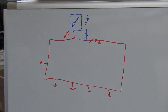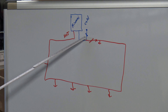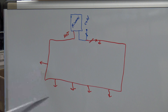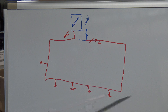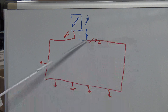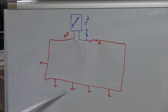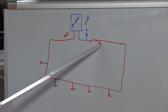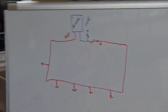Here on the dry erase board: a typical house layout. You have your Rinnai, your cold water with check valve into the tankless, then hot water out to fixtures one through eight or however many you have, then it comes back into the T. Shut off the ball valve so you can bleed this whole line. Once you get no more bubbles and smooth water flow, shut your hose outlet valve and turn the ball valve back on.